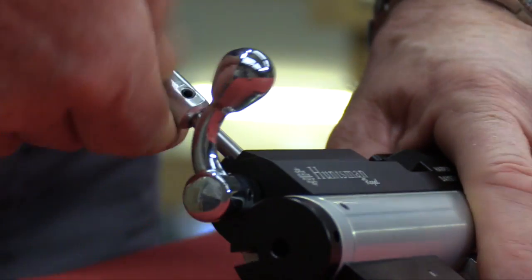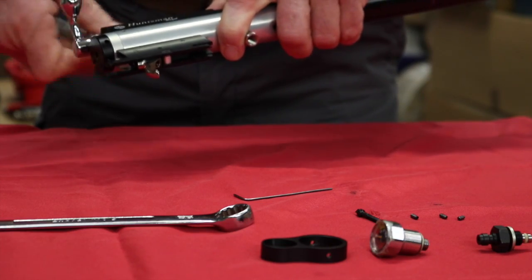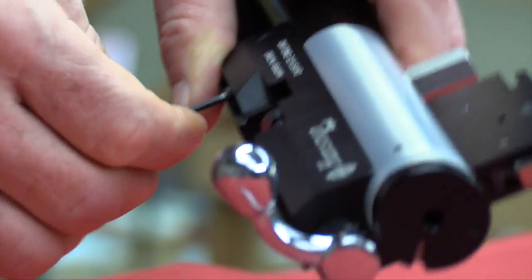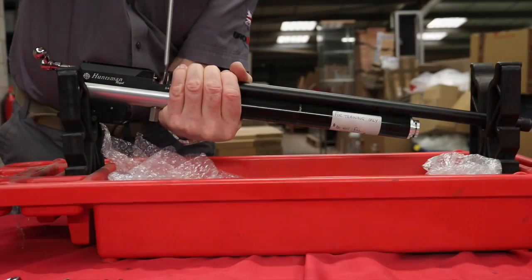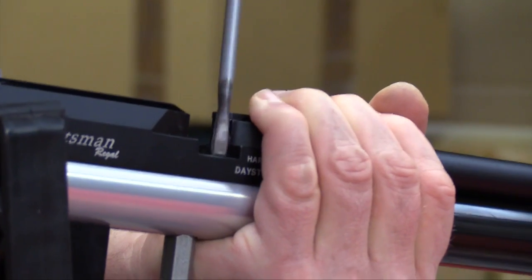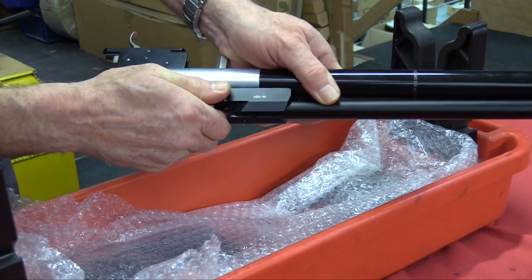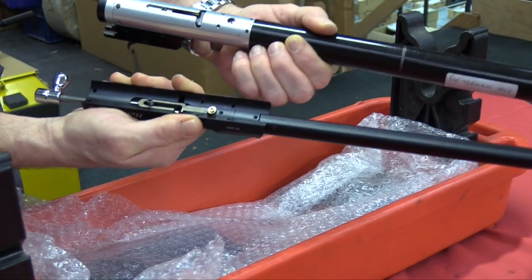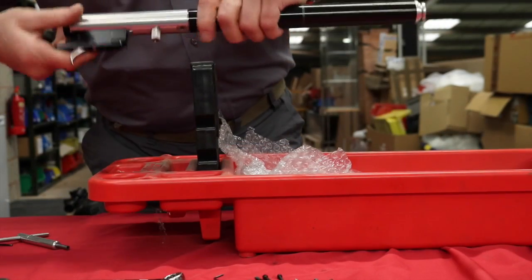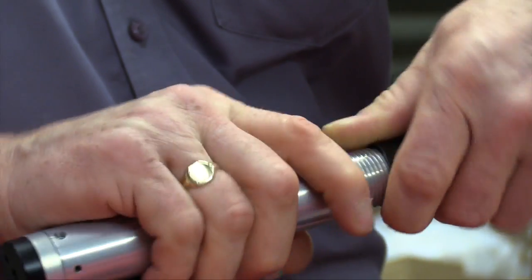Anti-tamper parts are fitted to the UK 12 foot pound guns; they are not fitted to high powered rifles. Removing the six screws securing the breech block gives access to the main body. The valve assembly can now be separated from the barrel.